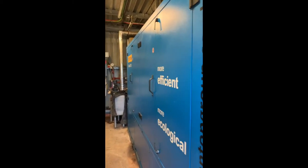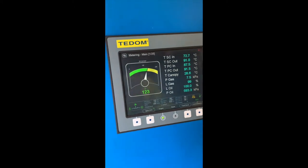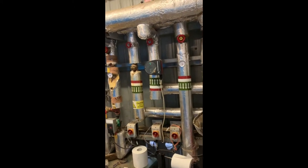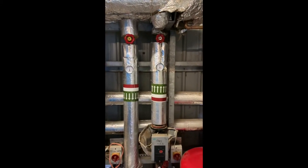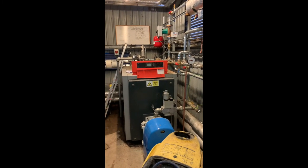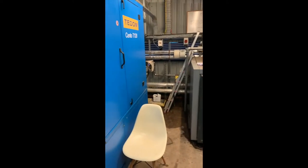Okay, so we're just inside our engine building. One of our engines here. Let's show you a close-up of the screen. It's producing 124 kilowatts of electricity and it's also producing about 160 kilowatts of hot water, which goes into this header structure here and is then fed into a district heating scheme, and also heats the tank and the second digester to keep that at a nice temperature. We've got a boiler there as backup in case the engine goes down — we need to keep heating the district heating scheme. I'll open up inside here. Close your ears, it's going to be noisy.